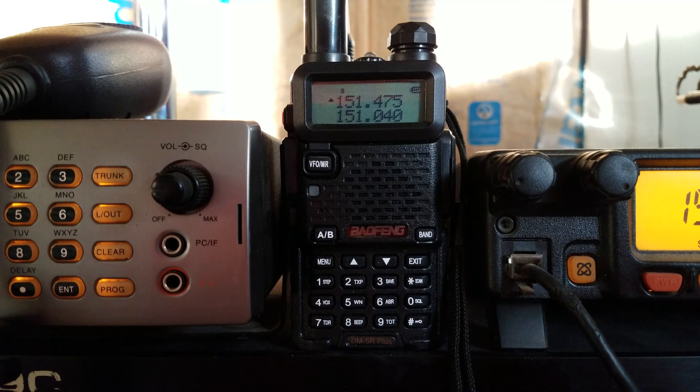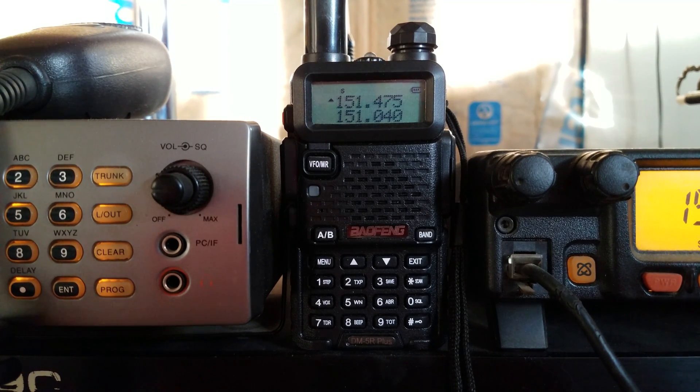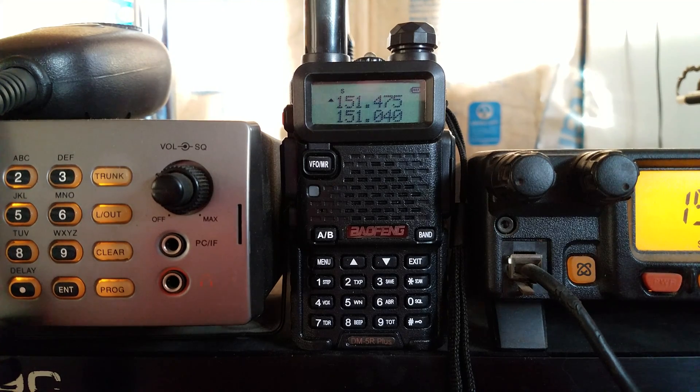It will only work with another radio that I set to that same ID. It's basically like a fleet of radios — you have one master unit with a set ID, then as many others as you wish, each with a slightly different ID. Another good thing about DMR is that you can make a call almost like a phone call, and it will be coded. You can put in the radio ID of the radio you're trying to reach and call it. These Baofengs don't do that as much, but those TYT 380s or whatever can do that.